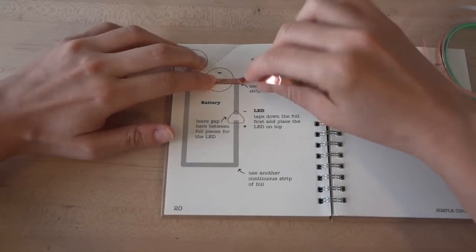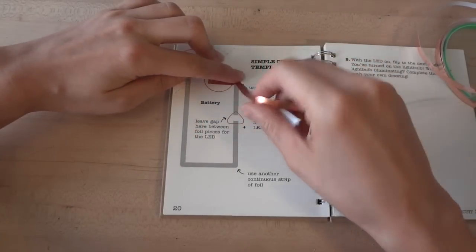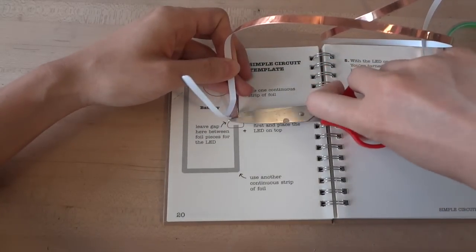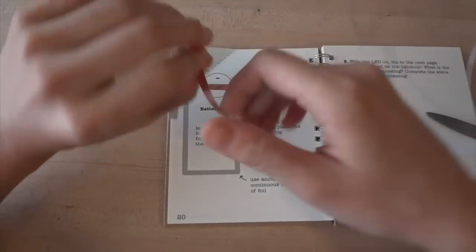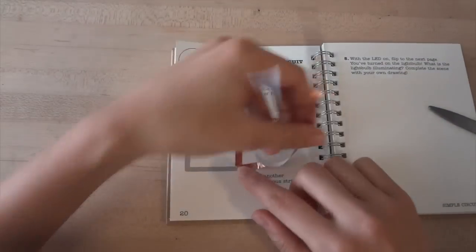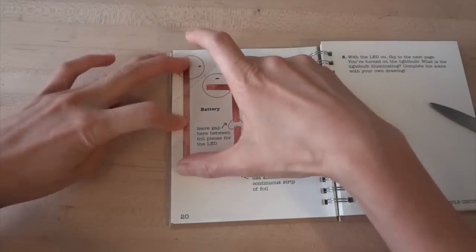To make your tape turn corners, fold your tape up away from the direction you want to go so that the sticky side is up, then fold it back down in the direction that you want to turn — this gives you a nice, clean, flat corner. To cut the tape, you can either use scissors or just tear with your hands. Fill in the rest of the circuit with conductive foil tape, and remember to use one continuous strip for each gray line, because when you tape separate conductive foils together, the connection is not as strong. Also remember to watch your fingers, as the tape can be sharp.